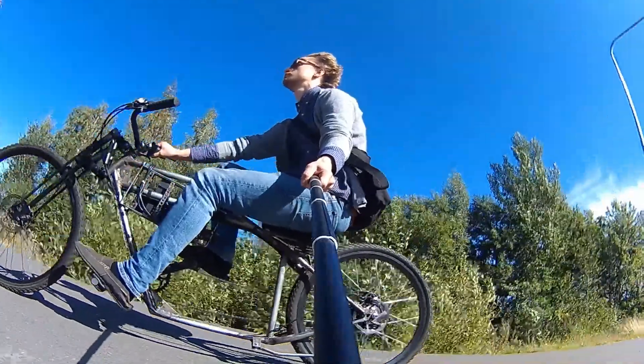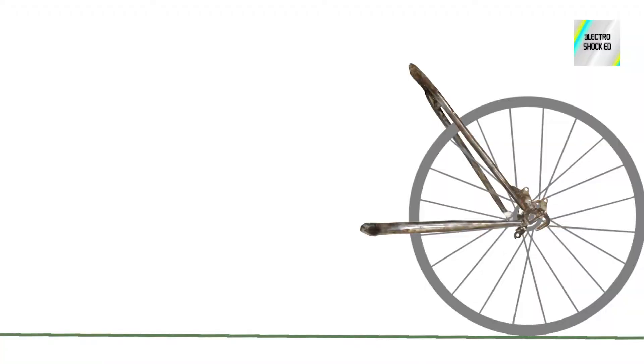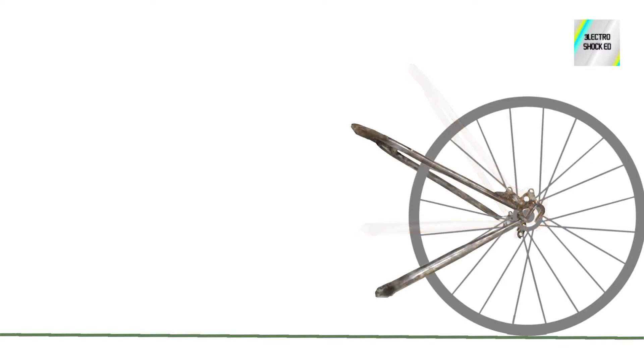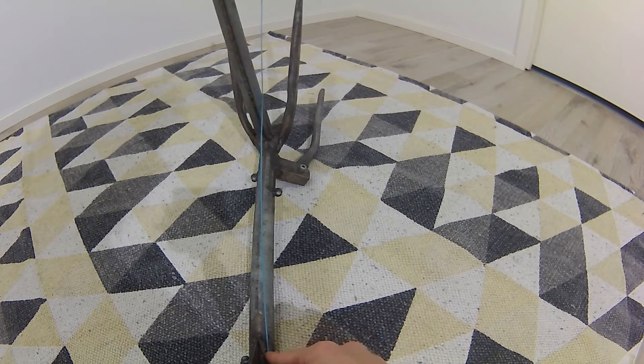For many years I was dreaming about making a cool stretched and low bike frame for a chopper e-bike project. I started designing and putting this frame together by chopping off a rear end from an old frame. Then I just rotated that part to make it closer to the ground, thus making the whole frame lower. I took a couple of bricks and used them to determine the ground clearance, then positioned the bottom tube on those bricks to get the angle I needed for that connection, and tack welded that tube in place.